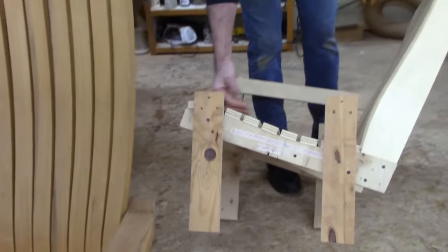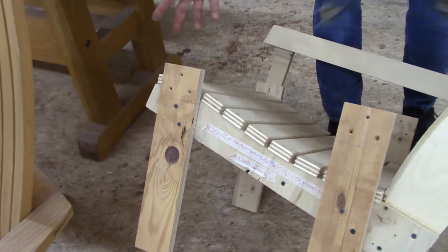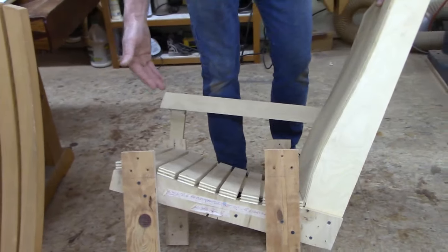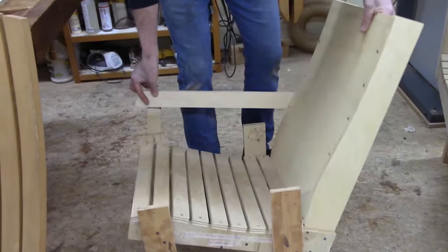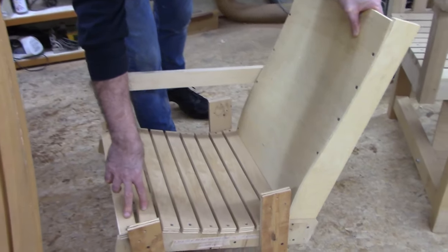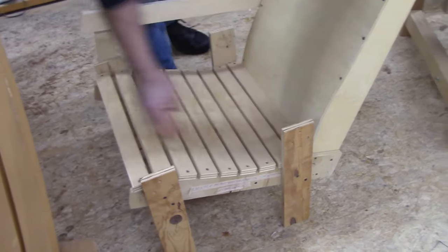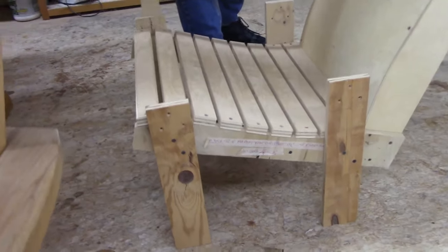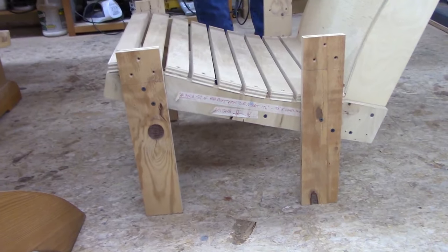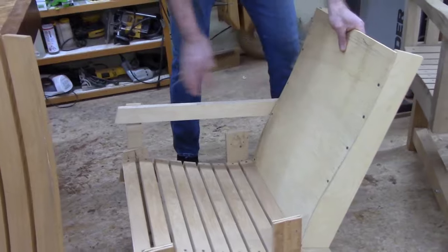I also took the curve I'd drawn for the seat and oriented it in space — figuring how high off the ground and what kind of recline I'd want. Using key measurements, I found that the front of most Adirondacks I measured is four inches higher than the low point in the back. So they really are pitched back — they scoop you up. When you sit in an Adirondack you feel it: your butt and lower back really hits that back support, so you sit into the seat like a recliner. It's basically the outdoor recliner.